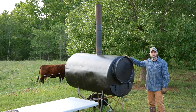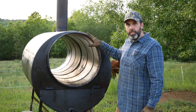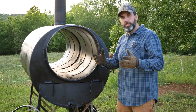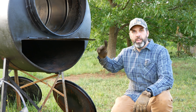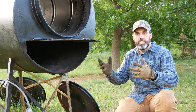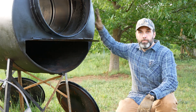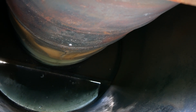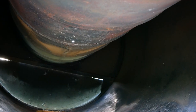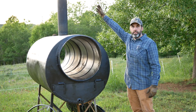Let's go over the design of the new kiln. With this design, he took a heating oil drum and then took two 55-gallon barrels, cut the bottoms out, welded them together, and inserted them inside of the heating oil drum. This is the firebox of the kiln and we've got a door on both sides, so we'll be able to load wood on each end and also remove ash from each end. We'll light a fire under here and then it'll heat these barrels, which will be sealed except for a small hole drilled in the bottom so that the volatile gases will escape and go down into the firebox to be burned off. When we get the fire going, the flames will wrap around the barrel, heating it up really well, and then the smoke will exit out the stack.